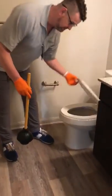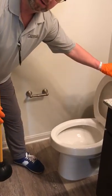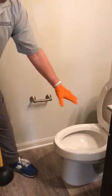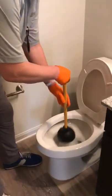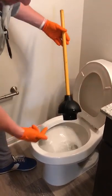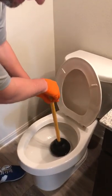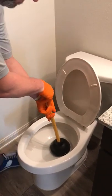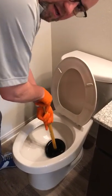So, we're going to open the lid — step one — and we're going to open the commode lid as well. Now, you've got a mess in here. You'll take the plunger and move away all the debris. Get the center of the plunger into the bottom of the bowl, and at that point, just force down: one, two, three.